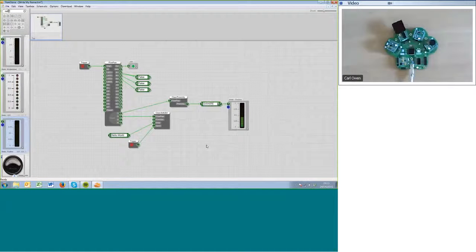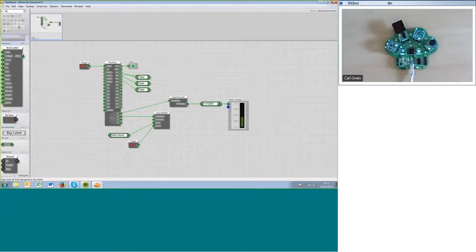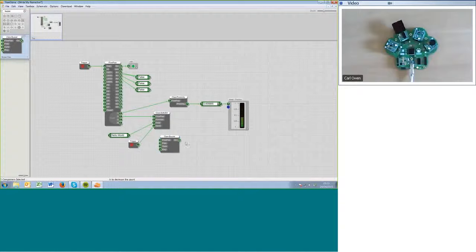If I bring in the buzzer here, which is on claw number 4, here we've got 3 inputs for you to control. We've got frequency, tune, and play. So frequency, as it says here in the writing, is actually a frequency 50 Hz to 8 kHz. The tunes are 1 to 49, and the play actually plays the tune. So if I just pop up a tune here, tune number 5, and press play, that's playing, if you can hear that on here. So we can make little computer type noises on the thing, or put in an actual frequency.